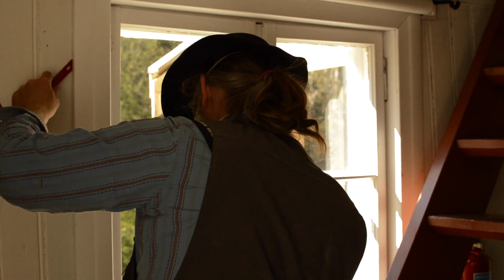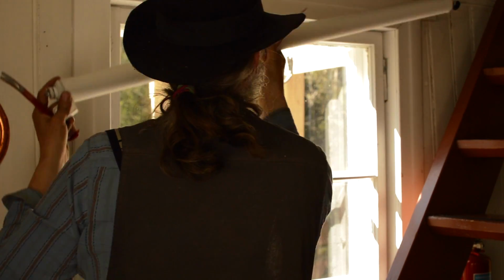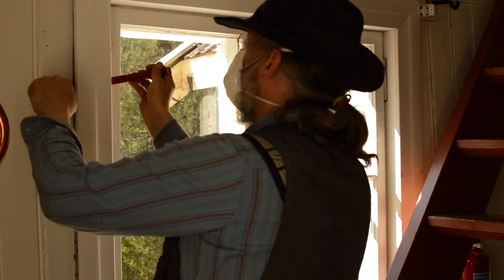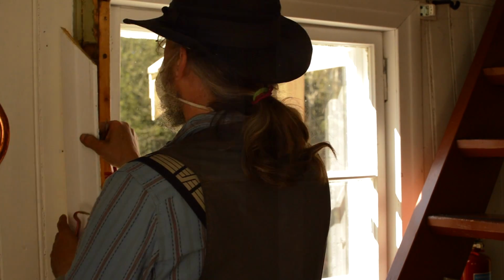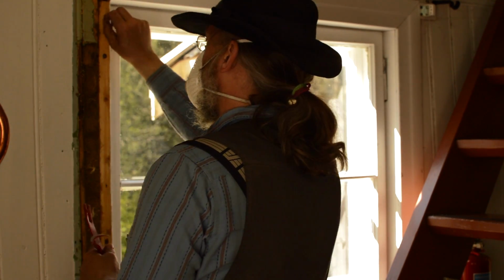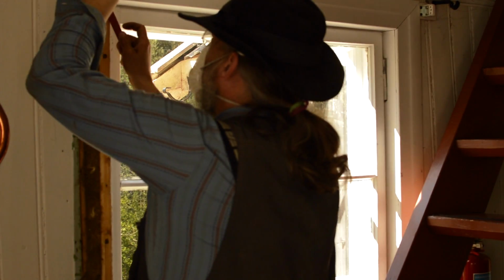Getting these interior details off, the mouldings, is quite tricky, especially when they've sat there for a while, but by using two small crowbars, trying to slip them in under the side and gently prise it up. Managed to get them off. Small splits like that I glue. It was difficult to get off because of the rusty nail. Sometimes it's to do with the paint making it stick.